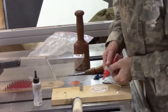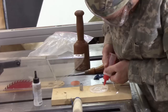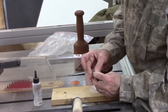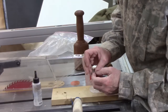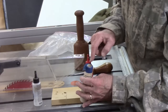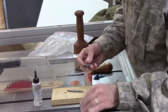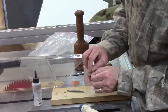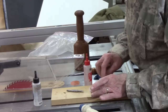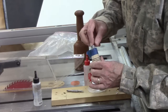One thing that remains is to put a little glue on the centerpiece — the tool bit holder. The critical thing is don't get any epoxy into the hole that the ball bearing will fit into on either side. And don't put too much in here because it may get stuck down inside and interfere with your tool bit holder. Apply it down here — some of it will slide up, and if it does get in there, be sure to clean it up. Mix this up, and make sure it's a snug fit as this one was.